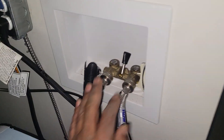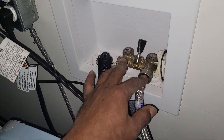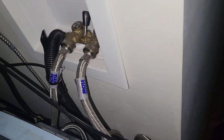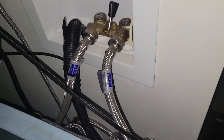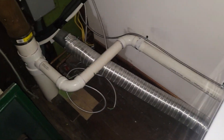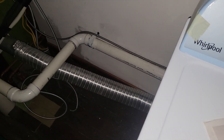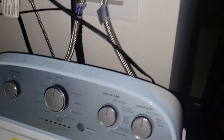We'll make sure this is added to the winterization process. If it went down to 10 below and stayed there a while with this valve shut off, it's trapping water up in the valve and in the wall. Whoever installed this should have explained: in the wintertime, take those hoses off and open that valve when you drain the house out. I can see this whole wall was taken out to get this apparatus in there.